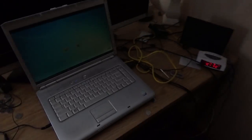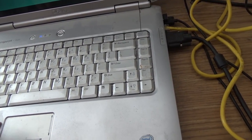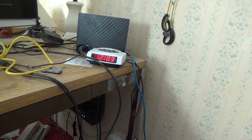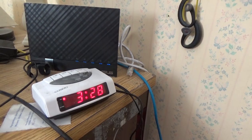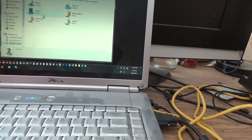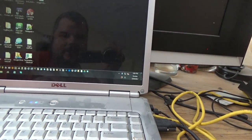Alright, let's get this laptop up and running. The next step is to run an ethernet cable, which I have right here — run that in there, up into the router, and go from there. Now we got three green lights. I've gone ahead and disconnected the hard line going into the other room. What I want to see is if I come over here on my laptop and click on View Network, I'm able to access my server. It's working. It's working. Well, shit on a shingle.